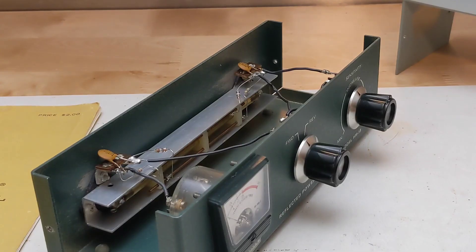Looking inside, the quality of the kit assembly was about average. I noticed that the two resistors inside didn't match the values specified in the manual for either 50 or 75 ohm versions — perhaps they burned out and the builder didn't have correct replacements. The actual values had also drifted significantly. I replaced the resistors with the values specified for 50 ohm transmission line, which is the most common and what I use. After replacing them, it gave SWR readings reasonably close to what I was seeing on my other SWR meters.